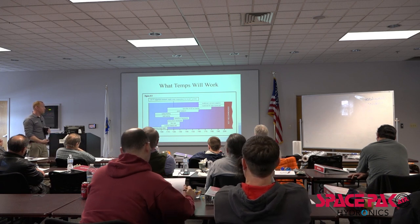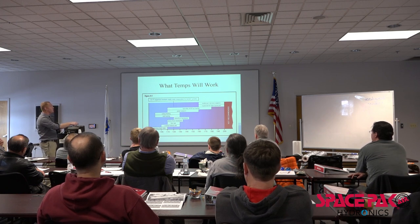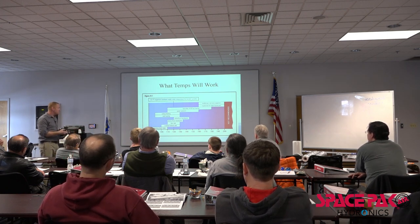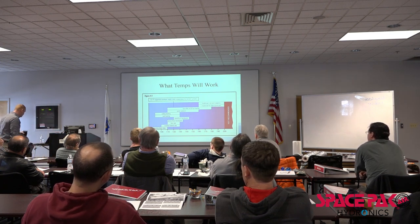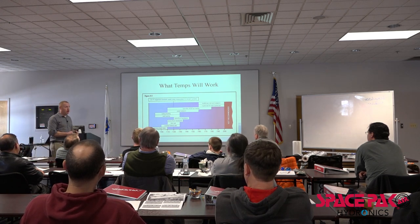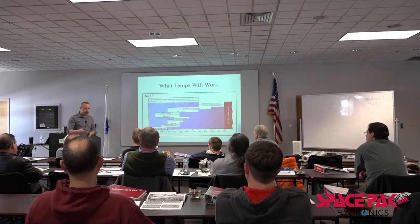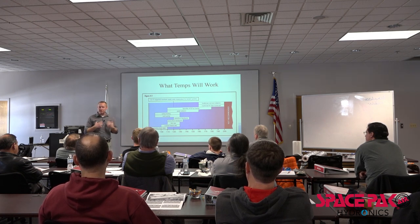With that 120 degrees, what can we do? We can use our air handlers. We can use panel radiators, ceiling, wall heating, underfloor, tube and plate, above floor tube and plate, thin slab, and covered heating slab. Now, it just so happens that that's a really sweet spot for our heat pumps to create that water temperature, right? We create up to about 130 degrees water temperature, but we can set our buffer tank at maybe 120 or 125, so we're ready to go for any one of those applications.